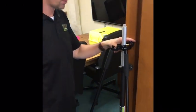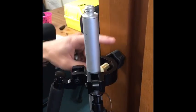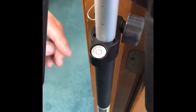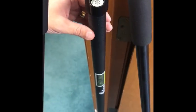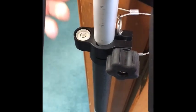I've taken this prism pole and leaned it up against the wall. I released the bipod legs from the lower section and put it up on top, tightened the device onto the neck of the prism pole so it's got pressure against the wall. Then I took this prism pole and leveled it up so it's perfectly level, by moving the bottom of the pole over and out until the bubble was perfectly level. I released the base so it spins freely, and rotating it 180 degrees it should stay within the bubble if it's accurate — and it is, which means when I take a measurement with my prism, no matter where I look at it, it's going to be perfectly level.